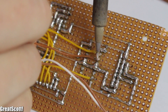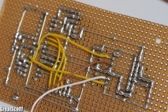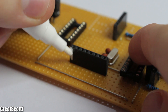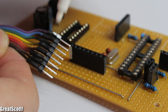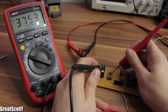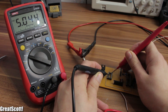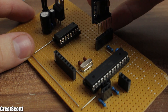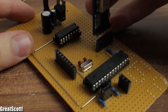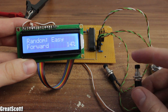The last step was to connect the motor wires to pins 3 and 6 of the L293D, and I also marked which orientation the female and male headers should connect in. Now it's time for a test. I gave the board power and checked whether there really are 5 volts where they're supposed to be. Then I inserted all ICs and used my FTDI breakout to program the ATmega with the code a friend of mine made. And apparently it all works fine — awesome!